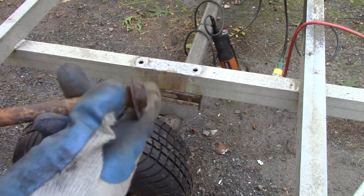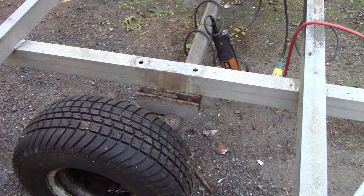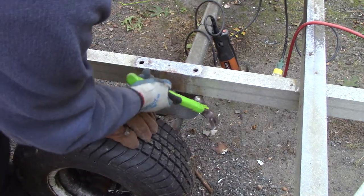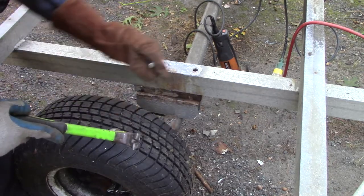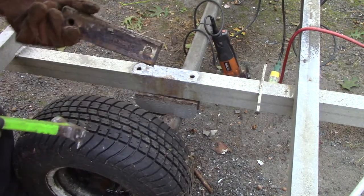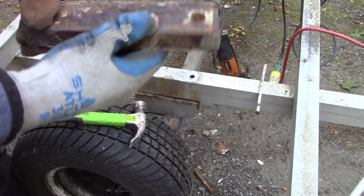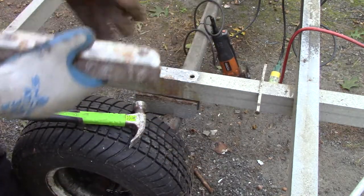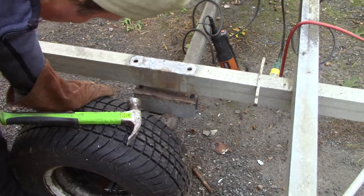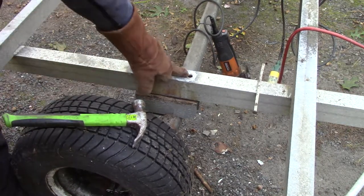I just drove out the bolts - I doubt they're stainless. This washer is paper thin now. You buy an aluminum trailer because you think 'yeah, it'll never rust,' but they didn't say anything about corroding. I want to see if I can knock this steel plate out. That comes right out - I hope the bottom isn't as bad as the top. This is a big honking piece of solid thick steel. I can feel the Alka-Seltzer down there but it is pretty thick material.